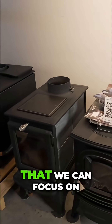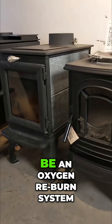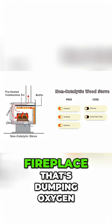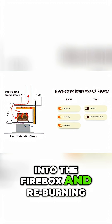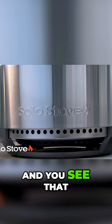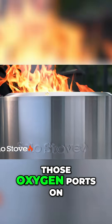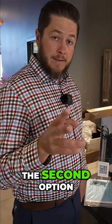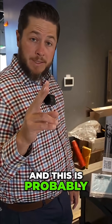There are three types of re-burn systems. The first is an oxygen re-burn system, where oxygen tubes above the fireplace dump oxygen into the firebox for re-burning. If you've ever seen a solo smokeless stove with fire coming out of those oxygen ports on top — same exact principle, but that's in a wood stove. The second option is the catalytic combustor.